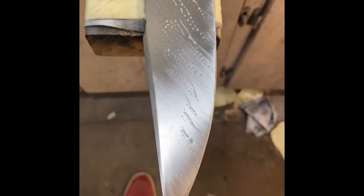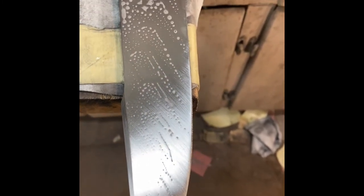Use Windex for your liquid — don't use WD-40, especially if you're going to etch the blade later. You don't want oil having been on it at all; you're just making it harder on yourself. Windex is cheap, WD-40 is kind of expensive, and it'll be less of a mess. Okay, so there's a couple more tips — back to hand sanding.